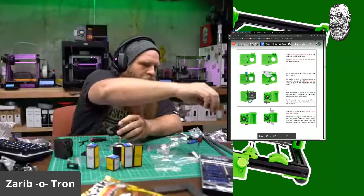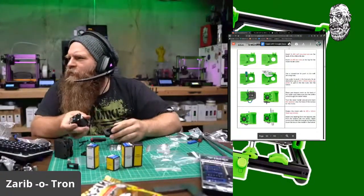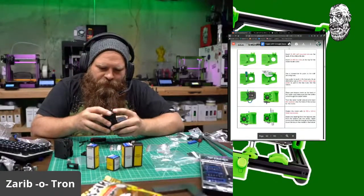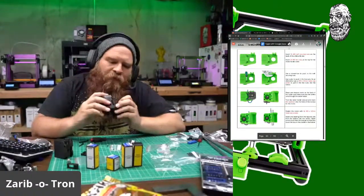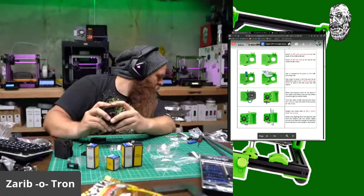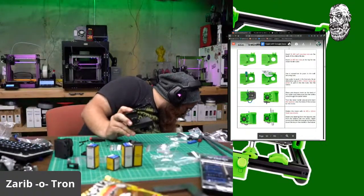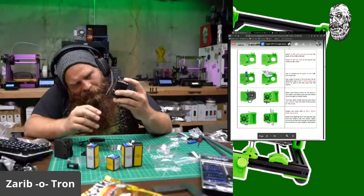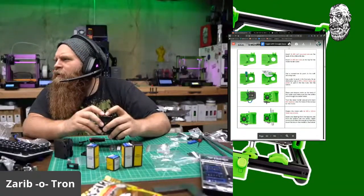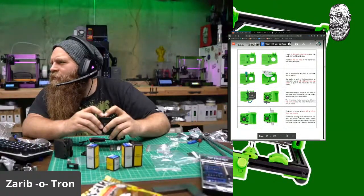Okay, and then a motor. So the motor goes down, then up. Oh, this is going to be fun. So there's a nice little spot here for the wire to go. I don't have the wire attached, and I have no idea where I have my motor wires for this thing hiding. They could be anywhere, in any drawer. So I'll have to reattach that later. Not a big deal. Use pliers to push as an alternative, to pull the nuts in. Turn the motor holder around, insert the M3 washers into the hole. Okay.